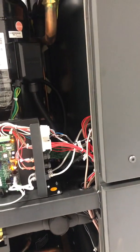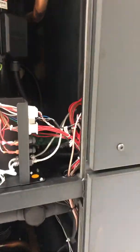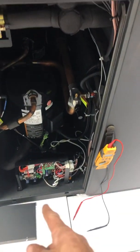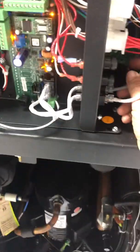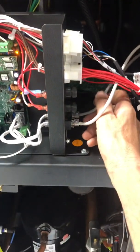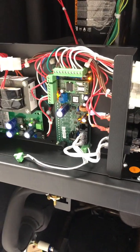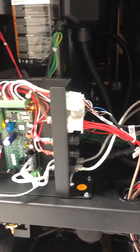Basically what happens is this: on the DSC, it comes from the controller down to the bottom one first, out of the bottom one up to the top one, and it ends at the humidity control sensor, which is behind the panel in there. So you're always going to see a return temperature and return humidity sensor fail if anything on this side of the line is dead.